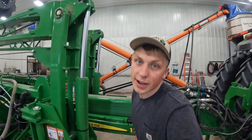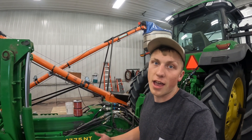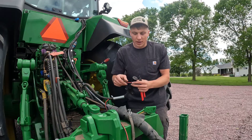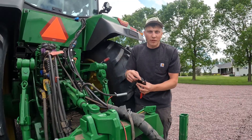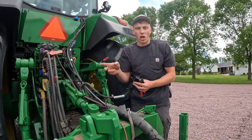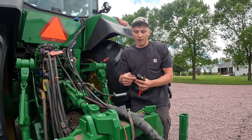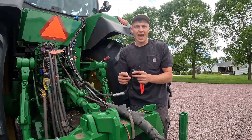In order to have access to this the whole length of the planter, I'm gonna bring the planter back outside, fold it out, and start running the cabling — shouldn't take that long. Here's that seven-pin connection I was talking about. I just need to look online to see which of these seven pins is the hot and which one's the ground. One of the benefits of going to the seven-pin versus the battery is that from inside the cab I'll be able to toggle the lights on and off on the display, rather than having to put a switch down at the battery.